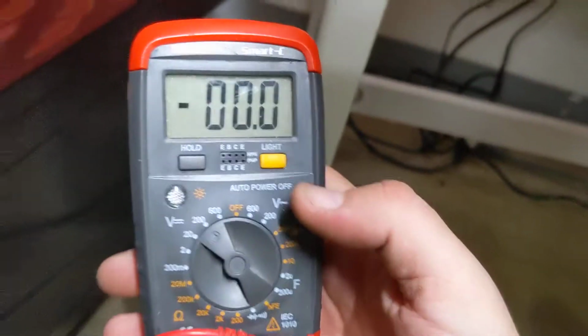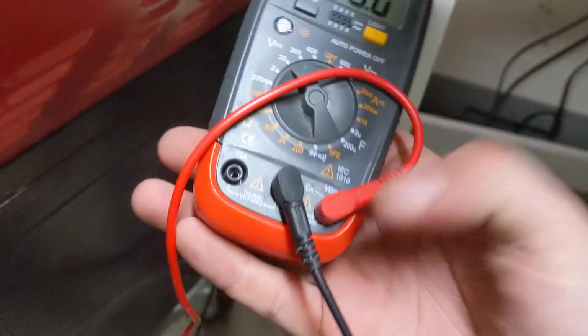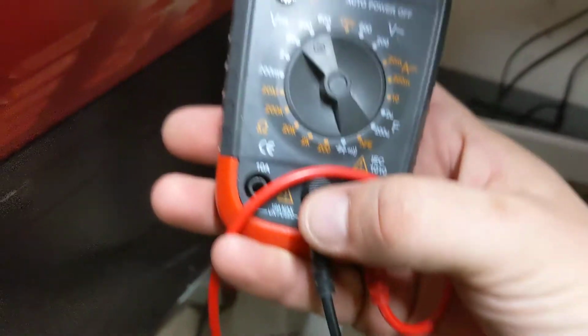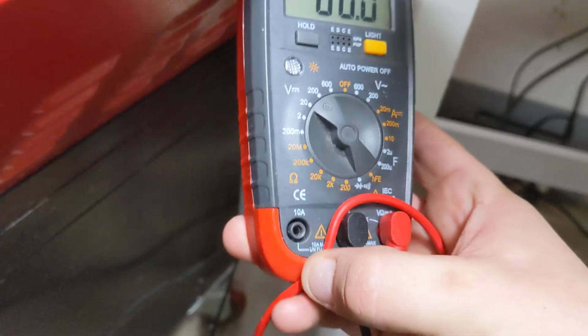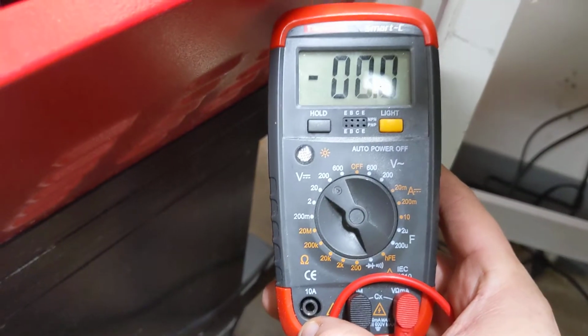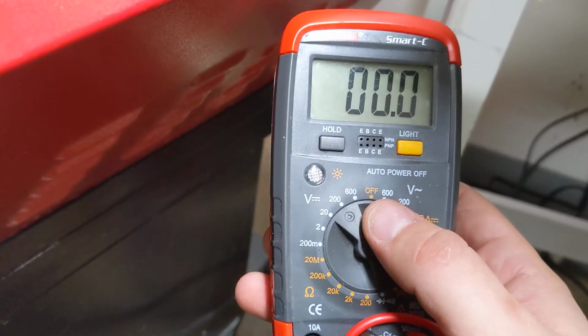And now I've got a multimeter. You can get these, Harbor Freight has a cheap one. You can buy a decent one online, lots of places to get it. And it's got 2 leads. Now typically these will have 2 or more places to put these leads in. And one of them is usually for current. So this one on the left is just for current. You'll rarely use this when troubleshooting. You can use it, but you'll rarely use it. Instead, you'll pretty much always use voltage.